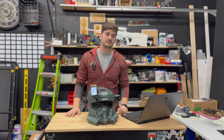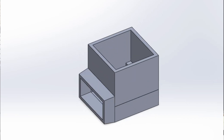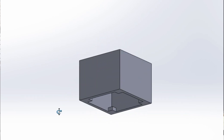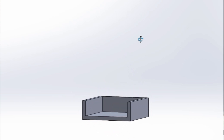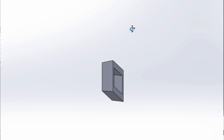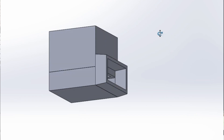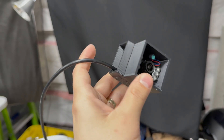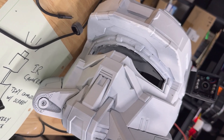Starting with the camera attachment, I basically designed a three-rectangle system in SOLIDWORKS. The first rectangle has little corners to hold the camera inside a box that protects all the infrared elements and the lens. The second one has an inlet for the cable and a 90-degree turn so it routes toward the helmet. The third is just a sloped standoff so the camera doesn't catch too much of the helmet itself in the feed. By poking a small hole through the side of the helmet, I connected the camera to the side, got the cable routed on the inside, and we were cooking.